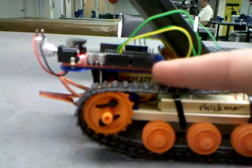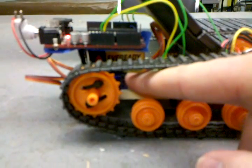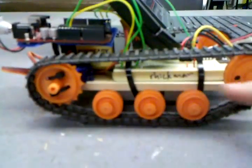We've got the Arduino board, 9-volt battery for power, servo hooked up to a little tank tread kit, breadboard, inverter for the serial input coming out of the phone, and then a G1 phone running a Python program that opens up an incoming telnet port, and then whatever comes in, it just sends those out over serial to the Arduino.